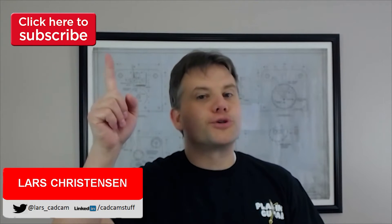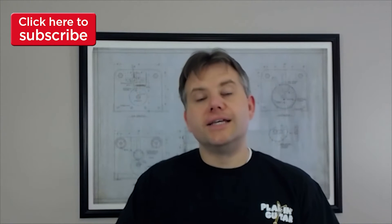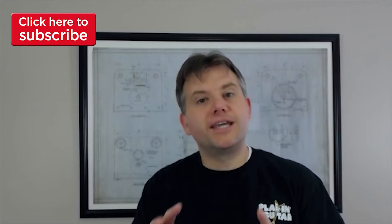I would appreciate if you take the time to also subscribe to the channel. One question I've gotten is that in the How to Learn Fusion 360 CAM Basic Series, I talked about how I prefer to pick up the part in the upper left corner. My reason for that is that on the upper side is where your solid jaw is on your vice, while on the lower end you have the movable jaw, which actually has some play in it. So the solid jaw is definitely the most stable. The reason I picked the left and not the right is that normally the tool changer is on the left side, so it makes sense to pick up closer to the tool changer — but it doesn't necessarily matter.